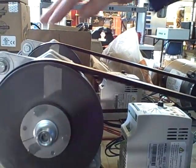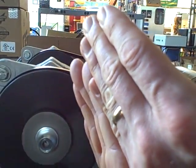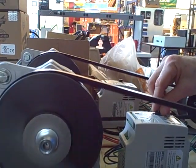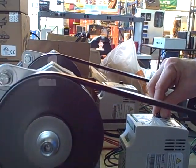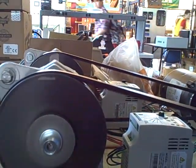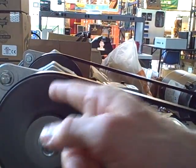Now I'm going to go the other way — I'll take the foreground generator's driver and turn its speed up to about 61 hertz. What we should see is another splaying of the angles where the foreground generator is actually driving ahead of the background generator, acting as the true generator in the system with the background acting as a motor. So I'm turning the frequency up to about 60.9 hertz — we're now trying to mechanically drive this generator faster than the one in the background, and as a consequence we see a slight splaying of the angles between the two tape marks.